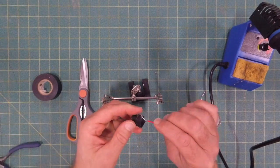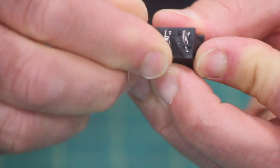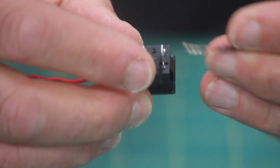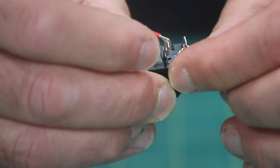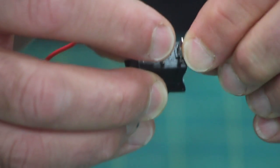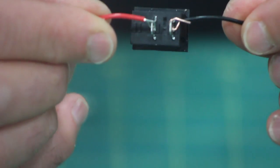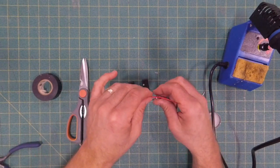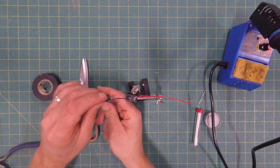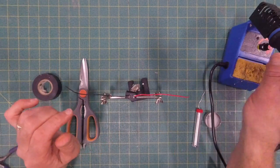So I have another couple wires stripped kind of long. I'm going to put one through the hole and bend it around that switch terminal. And I'm going to take the other one and do the same. I like to do both. I try to get these tight. They're not super tight. I don't twist them often because the terminals could possibly break off. These are pretty sturdy terminals though. I do both of them so that I can stick both wires into the clamps of the helping hands, because that helps me hold that switch in place. It's really hard to solder a switch when it's not held in place for you by the helping hands.